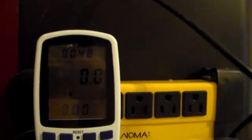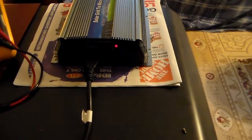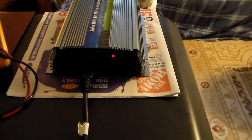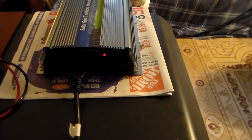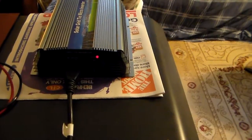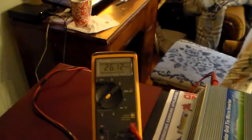We're set up here with our AC. Right now it's not turned on, so we're not getting anything at all. There is our unit. Turn it on. And that's all we get — it keeps flickering back to fault. It should go to green, and it should flicker on green while it's adjusting the power factor, and then shortly start outputting power, depending on how much input it has. Right now, at 26 volts, it should be close to full output. And what we're getting here is zero.